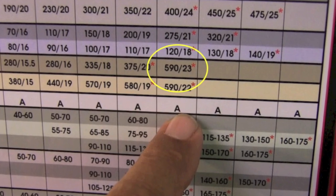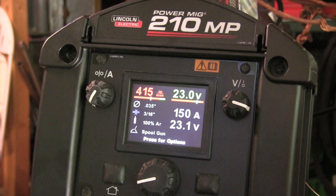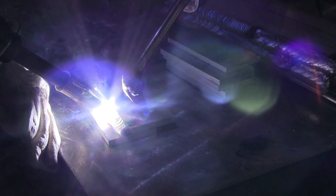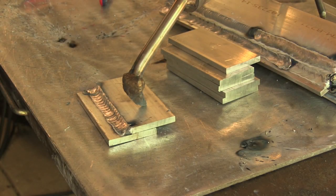I trimmed the wire feed speed down right away to 415, and even went a little lower than that. I burnt up a tip around 400, so I settled in at about 415. It ran better closer to 400, but I was on that ragged edge burning up tips. So for part of the weld you'll see no spatter, and then you'll see some spatter come in. I set the wire feed speed just a little higher than optimum to keep from burning through tips.